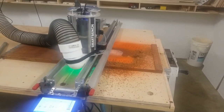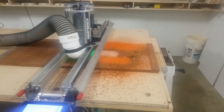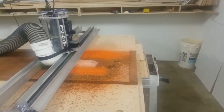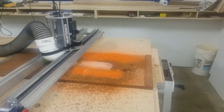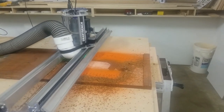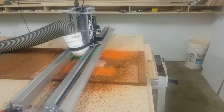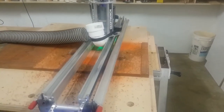I didn't think about cutting depth, so the first pass is probably not past the upcut portion of the spiral — but that's okay. I can throw a 60-degree chamfer bit on a toolpath afterward, or just sand and round the corners. I did not pull up the tape — just let it cut right through it — but I do need to connect my dust collector.